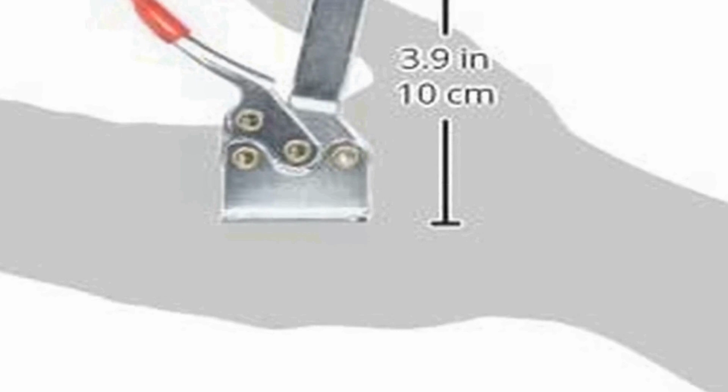Clamp specs: base 1 7/16 x 1 5/16, mounting slots 1/4 by 3/16, spaced 1 inch by 7/8, bolt length, including rubber foot, 1 7/8.